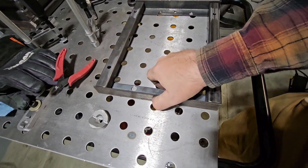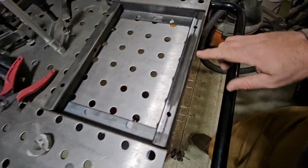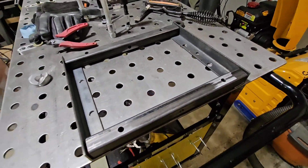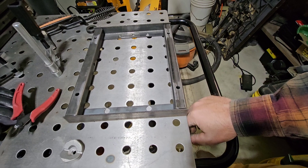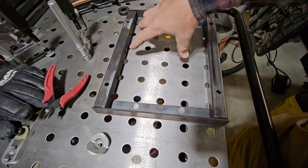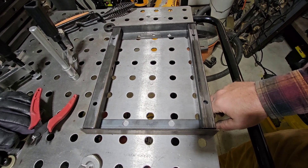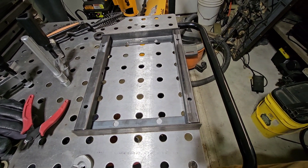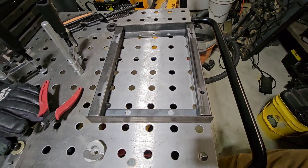These holes are for the spring pins, and these holes here are for the bolster pins. It's not a normal bolster truck. These pins, where the bolsters go, they go in slots — not holes — on the locomotive side of things. That allows the truck to go up and down, allows it to float basically on the springs. Then when you lift the engine up, the trucks don't fall off, which is very important.